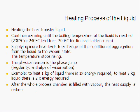The heating process of the liquid in the vapor phase system involves heating the fluid to create the transfer mechanism. We heat the fluid to its boiling point by supplying energy through heat mechanisms attached to the outside of the machine. Ultimately, this creates a latent heat transfer mechanism where you get zero change of temperature but a change of state, and in creating that vapor we create a thermal transfer mechanism through condensation to the circuit board.